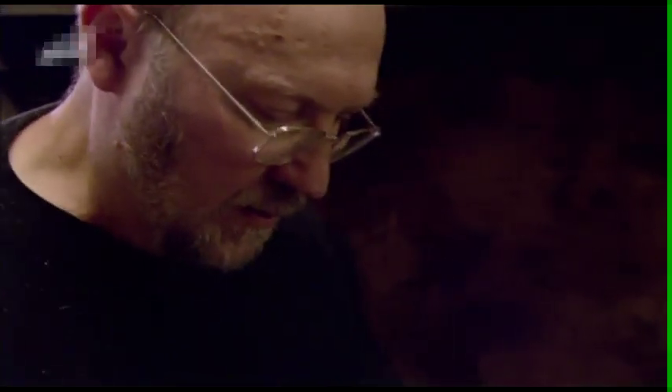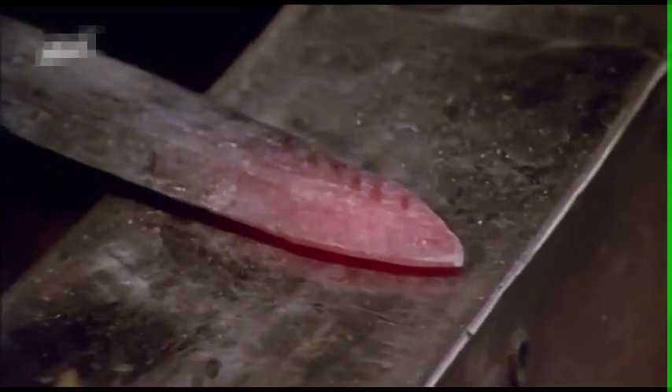The hard labour is actually high science. Dan's beating these dents into the metal to shape the bands of hard minerals that run through ordinary steel, like grain through wood. As Dan hammers, the steel's grain shifts from straight lines to a swirling pattern, like the spiralling grooves inside the barrel of a gun. Now the energy from any heavy impact has to travel all the way along these swirls before the blade breaks. The overall breaking strength is roughly doubled because of the longer path the crack has to travel.